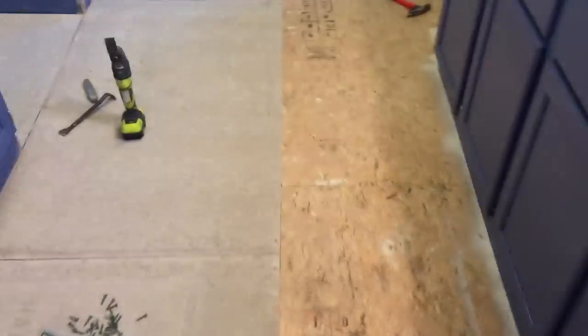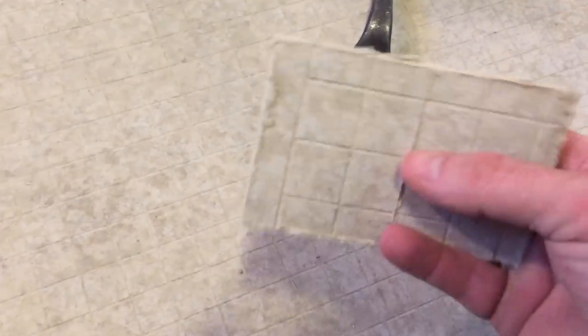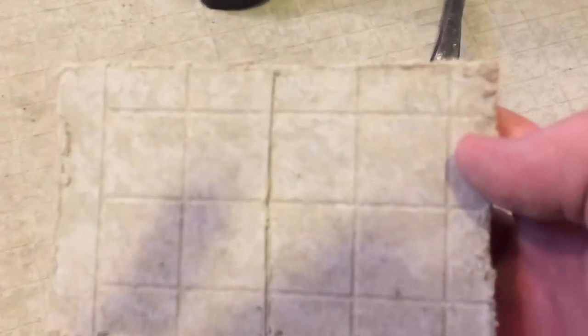There's an open pack here, let's see. We're putting in a basic tile because we got it pretty cheap. This is going in a little rental house. Anyway, as long as your subfloor is good and solid, I'm using a hardieboard — these are 3x5 sheets, you can get them at Home Depot for $14 each. Even with this hardieboard you're still going to score it. Here's a little example piece — I've scored that right down the middle there.